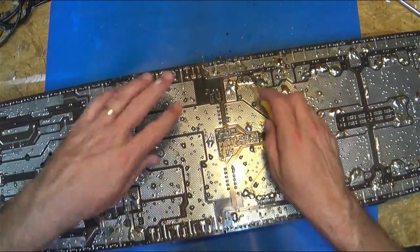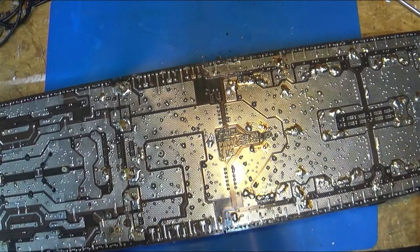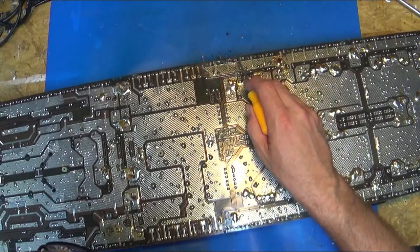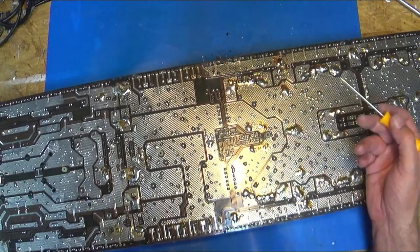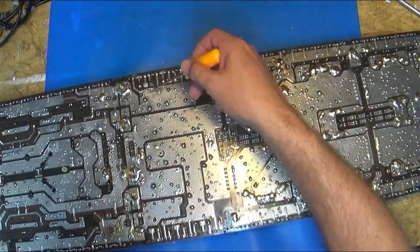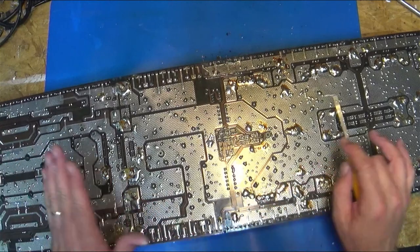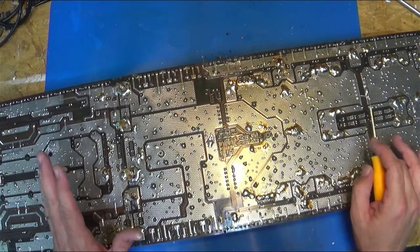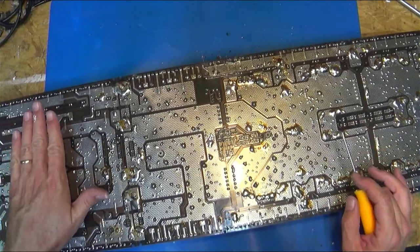Whereas if you're trying to leave some of it, it depends. On the power supply side, it might be a little more forgiving if you really cleaned it up good and didn't assume all that carbon was conductive. But after you make power and the rail voltage goes way up, over here on the output side, you can't have even a trace of conductivity at all, because it'll screw everything up. Because now you're dealing with high voltages.